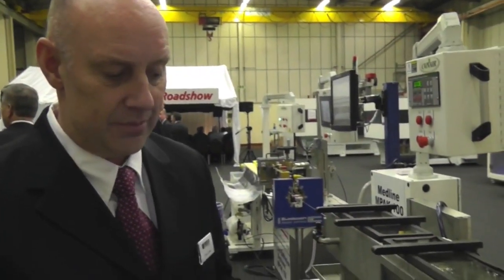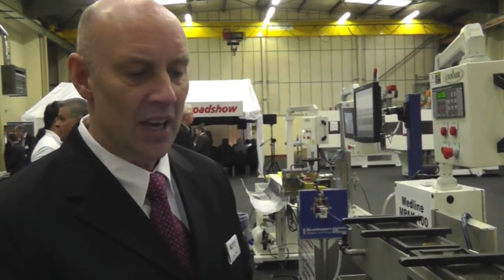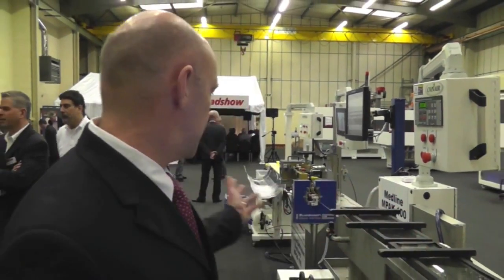It's quite popular for manufacturers to supply a complete medical package. Taking dialysis as an example: the dialysis machine you see at the bedside is no longer assembled and laced up by a technician. To save money and improve quality at the point of operation, they have a system on a flat pack, predetermined with different size tubing. We've got some of that tubing at the end of the line — you'll have 12mm tube to go around the dialysis pump, with fittings on.